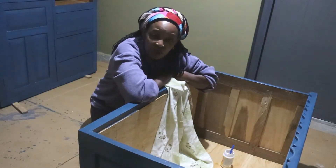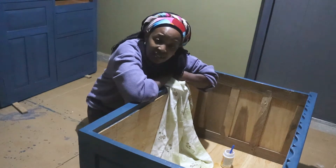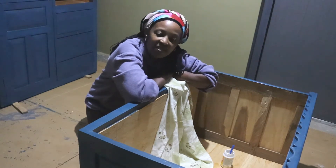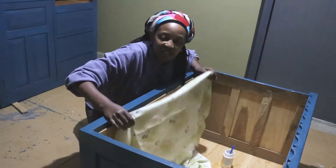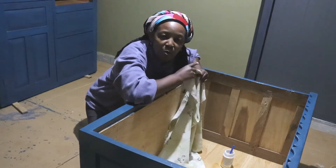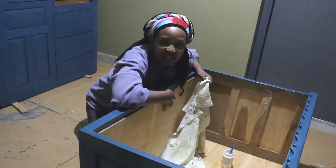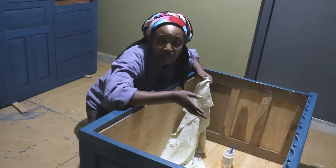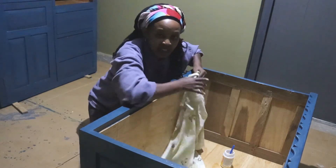After our two coats we apply NC paint with clear wax so that it can have a nice finish. As you can see from the back, our wall unit is almost ready. Now we are working on the top bit — the open space where we removed the glass doors. Here is where we do our decoupage, using glue paste, in our case Mod Podge, to glue fabric on the wood so that it looks like it has always been there. Check the card above for several other decoupage projects we've done before.